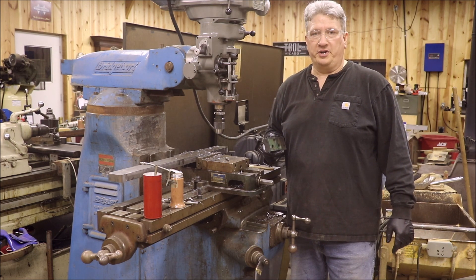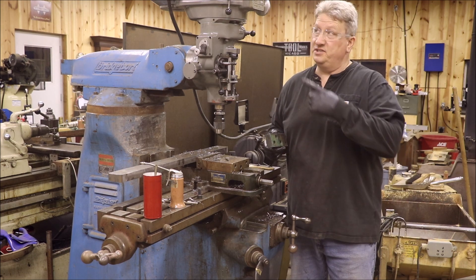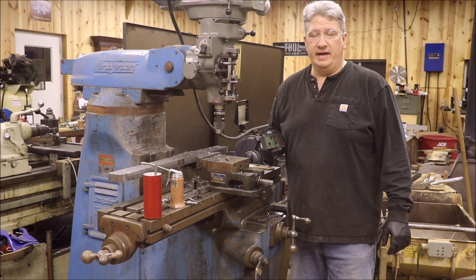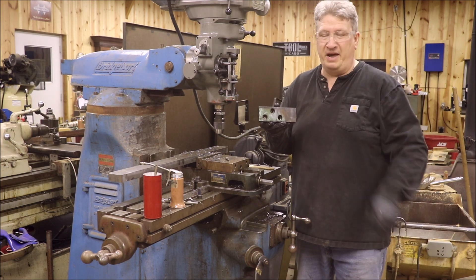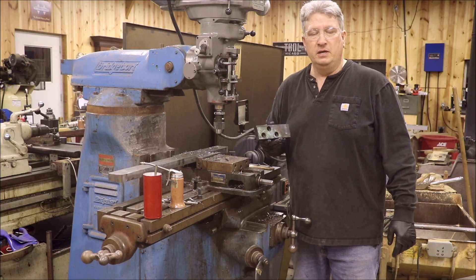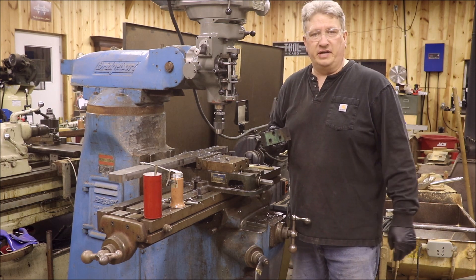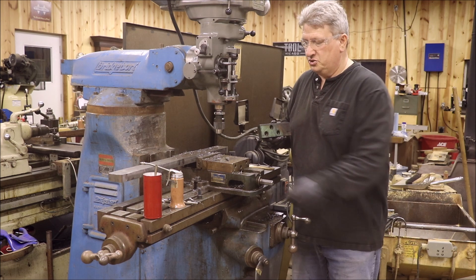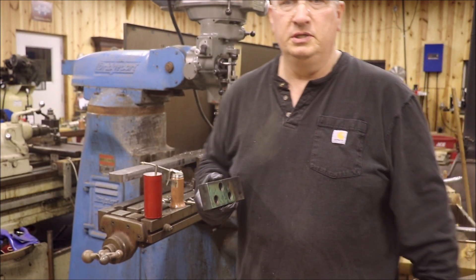Okay, we're over at the Bridgeport here. Some of you may have seen my shop tour from several years back where I had this in need of some serious equipment. I ended up finding a 2J variable speed head that was completely rebuilt from one of the OWWM guys and purchased it and put it on here at the last Arnfest. So what we're doing right now is we've got the bar complete and we are now drilling the holes to mount it back on the utility hacksaw. These three holes are the mounting holes. I've already spotted them with a center punch using the original as a guide, with two of the holes already drilled and counterbored. Now we're going to drill the last hole and then counterbore it to three quarters inch so the cap head screw will fit flush.